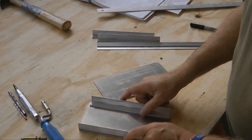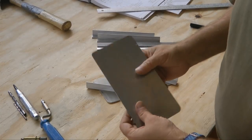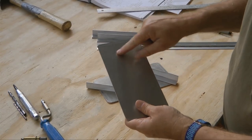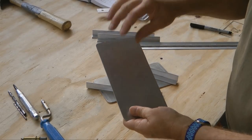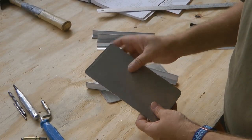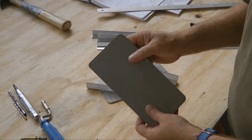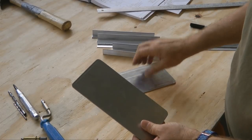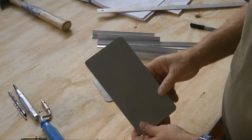And so the first step is lightning holes. This is awful substantial and we're trying to save weight, so if you notice in the plans it has some lightning holes, and the purpose for them is simply to reduce weight, and this is a good time to do it centered, and that relieves some of the metal that isn't that important for strength in this case, and our goal is that 254 pounds.